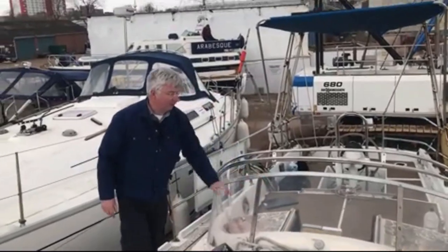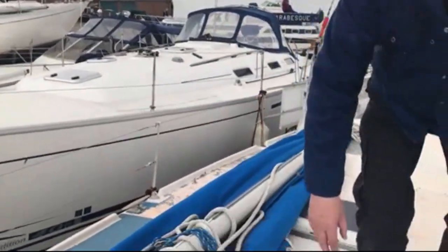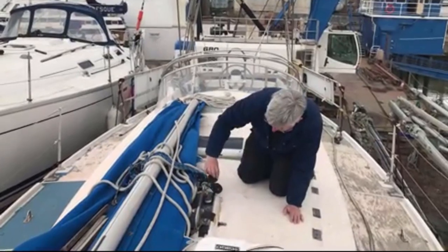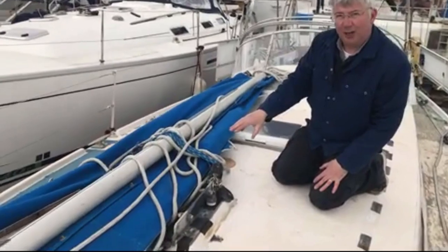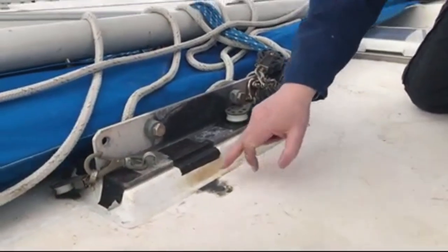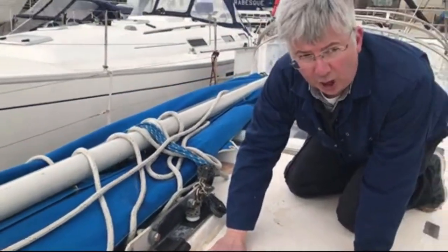These small windshields will crack on a regular basis, typically from the screw holes or bolt holes. I'm going to walk on the coach roof as well, checking for delamination, which is quite common. I've also looked at the mast step because I've found bulges around it. You can see bulges here and here, and there's cracking here, and this is quite dipped in, meaning the whole mast step has actually sunk.